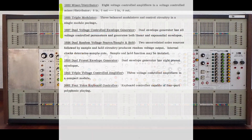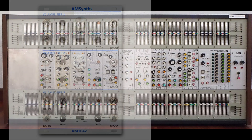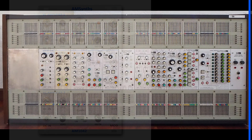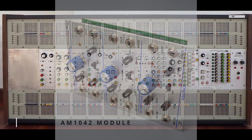The 1042 module is mentioned in the 1970 Tonus catalogue as coming soon, but no prototypes were made. The module provides three discrete transistor VCAs and would have used the circuit from the 1005 and 1006 modules as a basis. The 1042 is therefore easy to recreate: three transistor VCAs, each with two audio inputs and a CV input. The replica also includes the additional features of the 2600 VCA, with separate inputs for DC or AC coupled signals. DC coupling allows the use of CV signals, whilst the AC input eliminates the offset of VCOs. An orange LED shows the signal level coming out of each VCA.